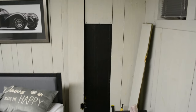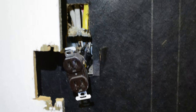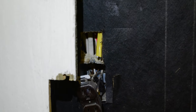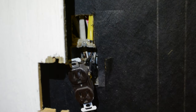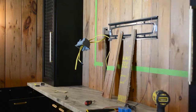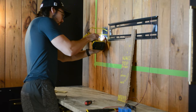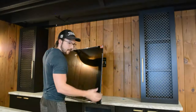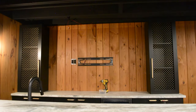I had to pull some boards off on this side in order to access the outlet. Here's that outlet — you can see those white cords that were already going to it, and then the yellow cord is the new one that I just fed down. I'll thread it through, attach it to all these other cords, connect it to the outlet, and then we should have power. I ended up switching it from a one gang to a two gang because I'll have my outlet here for the TV and also a dimmer switch for those LEDs in next week's video. I then plugged it in for the first time and it turned on — now we're officially done with all the electrical.